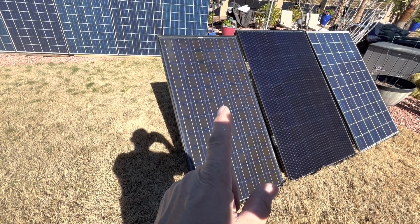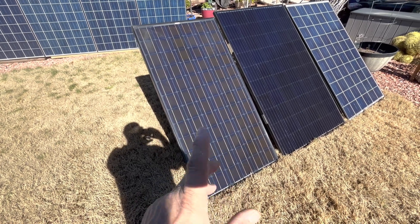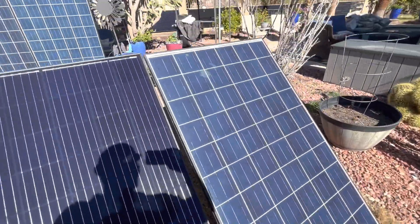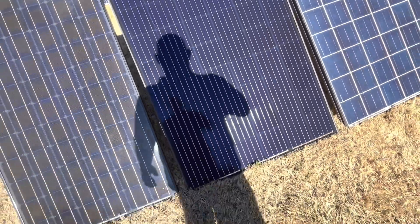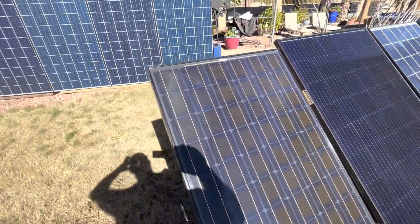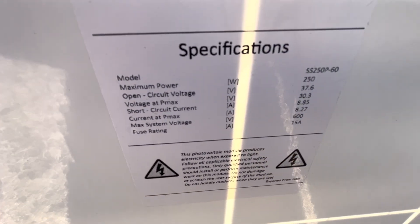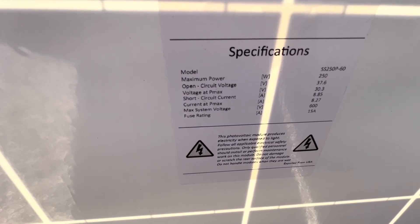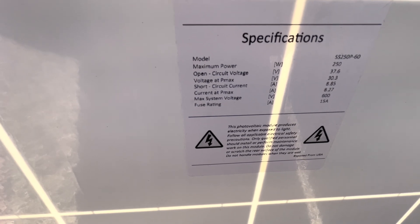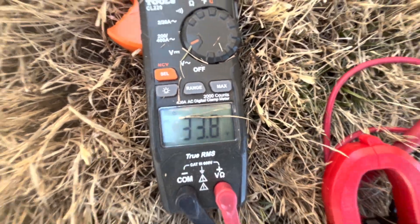These are 190 watts and they were really kind of cloudy with calcium buildup from water that was on there. They got some staining on this one over here. We're going to do a read with the voltage and the amps. Right now on these panels, the open circuit voltage is 37.6 and the voltage at Pmax is 30.3. We're actually getting 33.8, so that's a really good output.